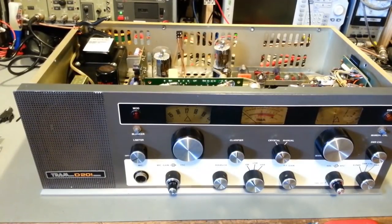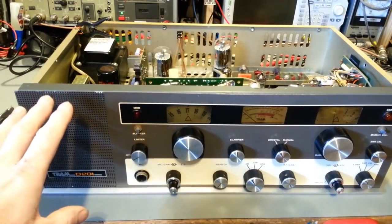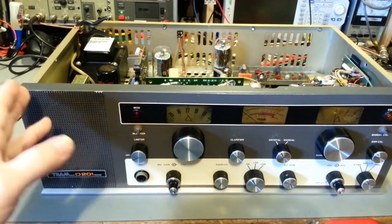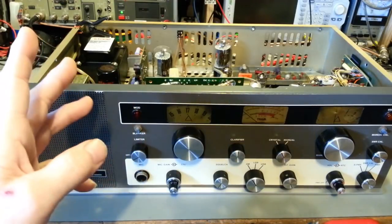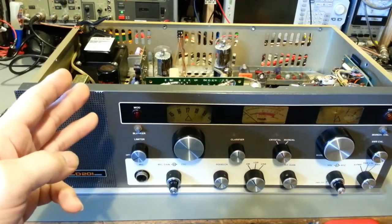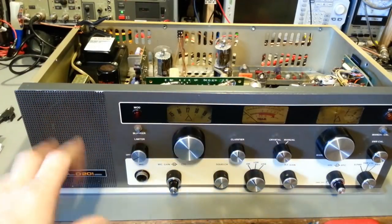Okay, so this is Moment of Truth. Actually, it's a few minutes after Moment of Truth. So I've got all the electrolytic capacitors replaced, replaced all the high wattage resistors, tested all the tubes. It did need three tubes. One of them was shorted, one had high emissions, and one was very weak on one section, a dual section tube. So those were replaced,